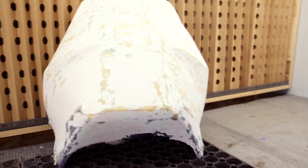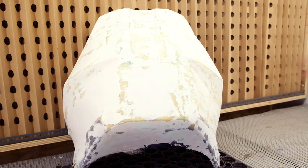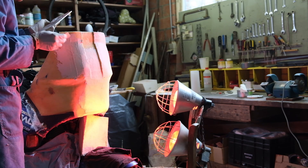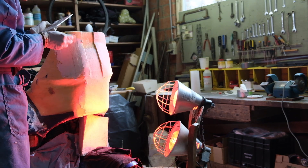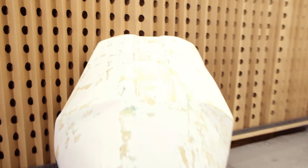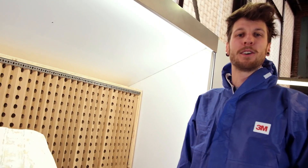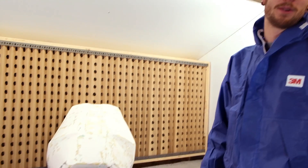It's around 100g/m² fiberglass — just the regular fine mat, which is easier to shape. Then a polyester putty to even out all the bumps and make a smooth surface. I'm pretty jealous of your skills there — adding bondo is like my weak spot. We had some training together, about five years ago, on a big project, and Ben helped me out — now I'm a bit more of a master at it.